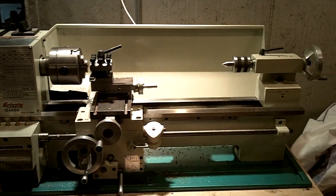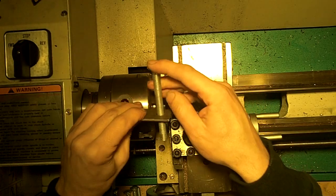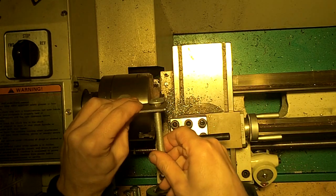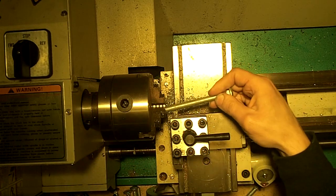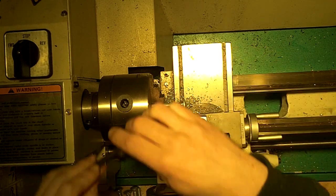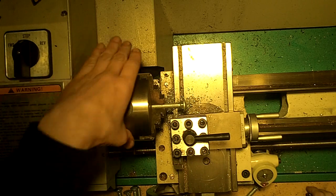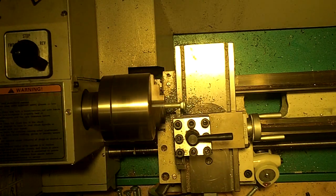And now, the perfect excuse to use one of my favorite tools. The bottom of the head of a carriage bolt has a square neck so it can grab into the wood to prevent it from turning. To get it to fit into the metal tab, I would either have to drill the tab's hole larger, compromising some of its strength, or turn down the neck of the bolt in the metal lathe. I chose to turn each bolt and then will regalvanize the area with cold galvanizing paint.